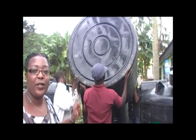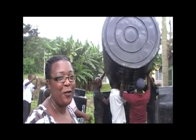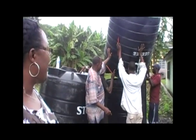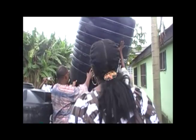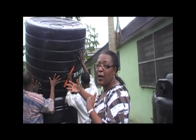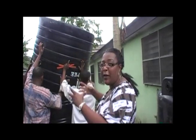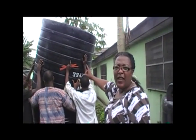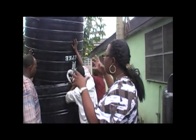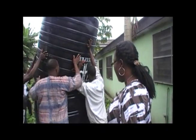We're testing the tank to see if the gas collector fits inside the base of the digester. You have to make sure there's at least a few centimeters of room between the gas collector and the digester so that the tank can move freely up and down. I think these were 120. Is this the ones that were 122 and 126? So there's just enough room for the gas collector to go inside the base.